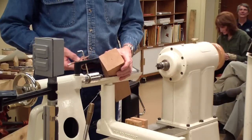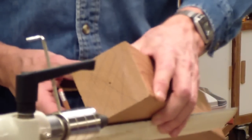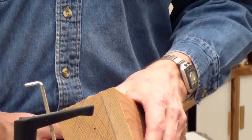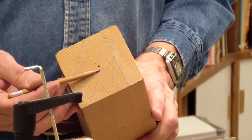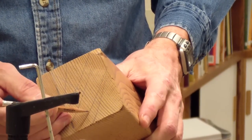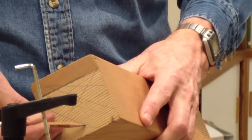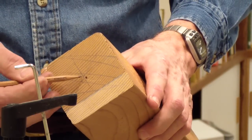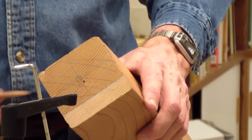Let's say that this is your new perfect square. Let me see which way it shows better. So let's say that that's the stock we have. We're way off center. So you would just come along and ride your finger down that edge of your stock, down that edge, down that edge, down that edge, and then where all these things intersect, right there would have been your center.